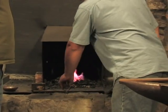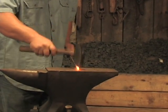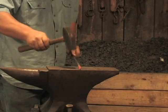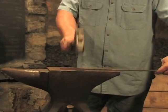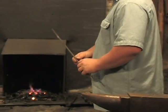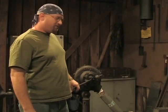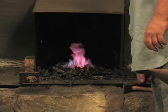Okay, so we're hot enough again. Now we're ready to do our jelly roll — yeah, you're about thin enough for it right there. Getting thin now so we can't crank it too much. This piece is pretty thin on the end so it'll burn real easy. I'm going to keep putting some coal here to the front so that keeps the flames from coming up and heating this up that I'm grabbing.